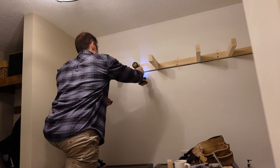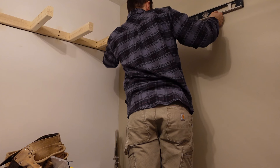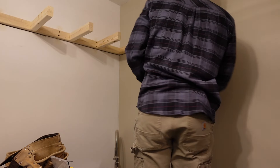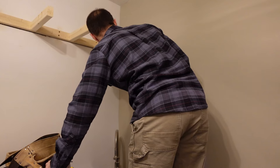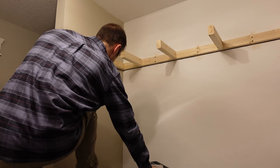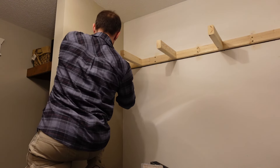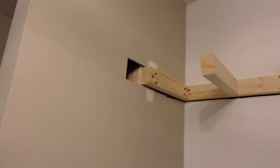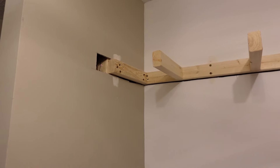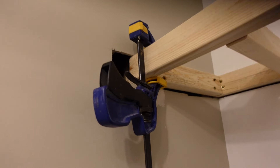For the sides, I'm going to drill those into the two by fours on the sides as well, which will give it more rigidity. I'm using a level to make sure that the shelf doesn't tilt backwards or dip down at the front — so everything's level. Obviously you want to keep using that level throughout the whole process. Now the two by fours on the sides weren't in ideal positions, so I did add a few pieces of two by three just to extend them out a little bit. These pieces on the end are really going to hold things together and prevent the shelf from dipping down, so I'll be able to put a lot of weight on this thing. You can see I drove two or three screws into pretty much every two by four that is behind the drywall.